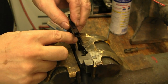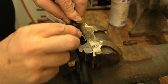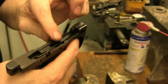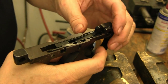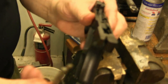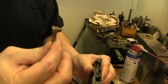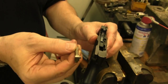And that has to fit into the notch that's down below. Basically you have to start out tight and at an angle and get it in place. Again, you can test the trigger action just by pulling the trigger. Then the next piece to go in is the trigger bar, and this goes stud side down into the trigger group. So it's going to fit in like this.